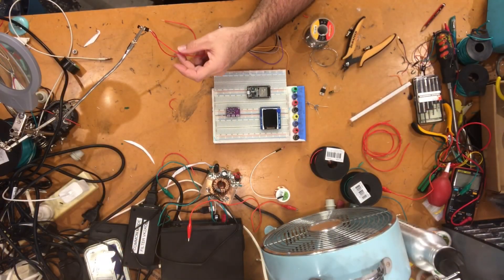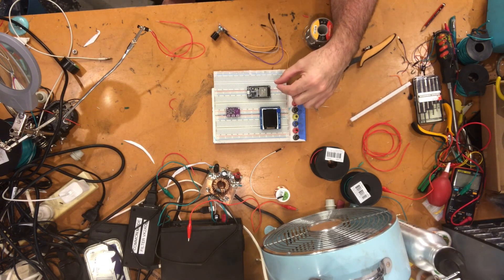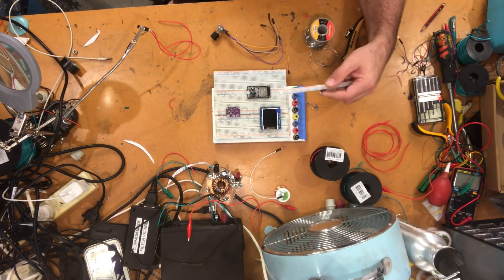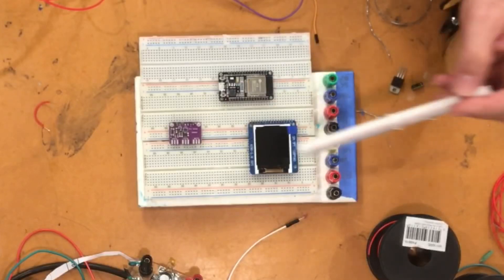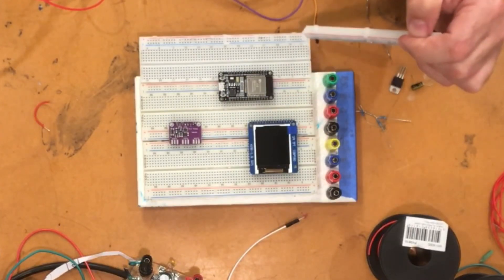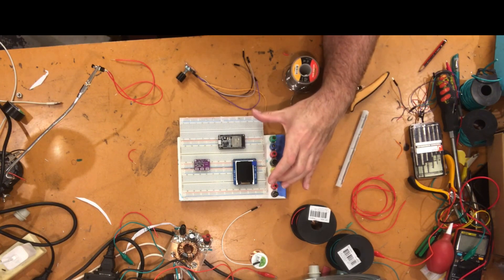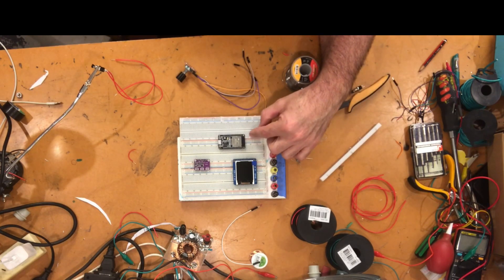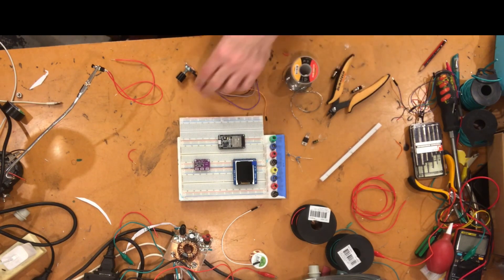I started building — needed to put wire on the momentary push button switches — and we already came up against the first problem: the ESP32 development board is very wide and doesn't sit on normal breadboards. I had an old university board, ripped everything off it, took a side section off, and joined the two breadboard pieces together like Lego blocks. That gave me the right separation to get the ESP32 board on.